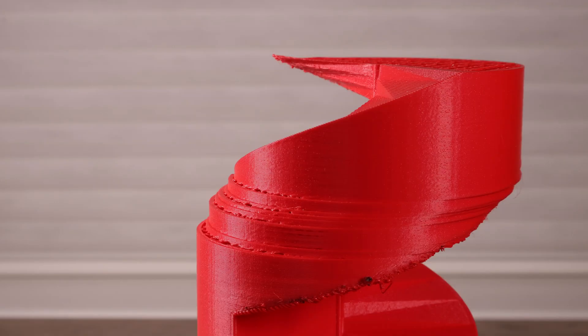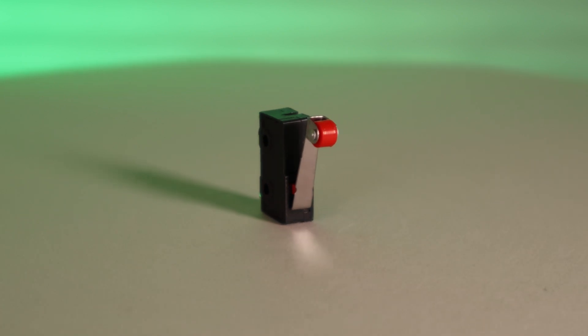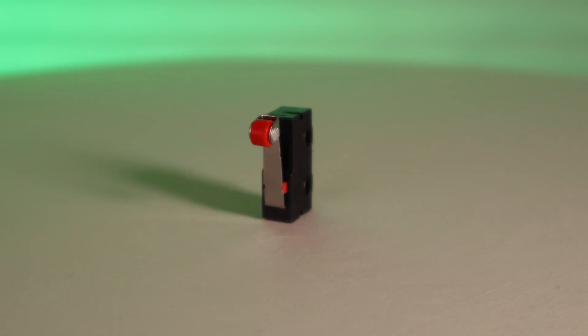The digital camera also gave me more control to take longer exposure photos. Getting the location of the printhead right is super important. If it's not far enough, the button just won't get pressed and you won't get any photos. If it's too far, you'll either break your remote holder or might get layer shifts. There's little room for error — maybe about a millimeter or so. After using the GoPro remote for a while, I switched over to a micro switch, which has a lot more give and allows more flexibility in the exact location of the printhead.